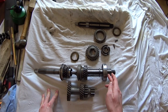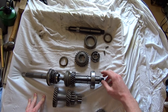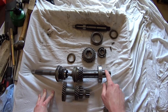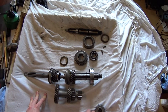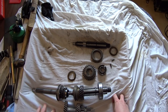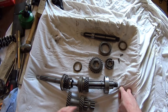You can rotate the input shaft and the output shaft doesn't move. The output shaft goes through to the back, connects to a big gear in your transfer case, and then sends the power out to your wheels. Unless you have the transfer box in neutral, the output shaft is constantly being driven by the wheels. So if you're moving forwards and not in neutral in the transfer case, this shaft is always rotating. Two shafts: input takes power from the engine, output drives the wheels.